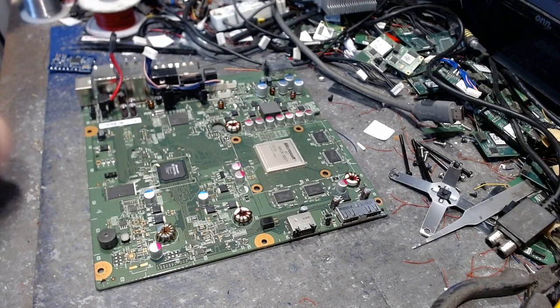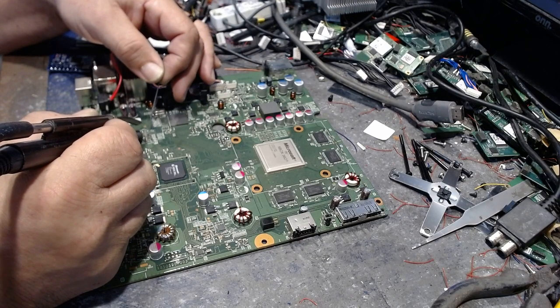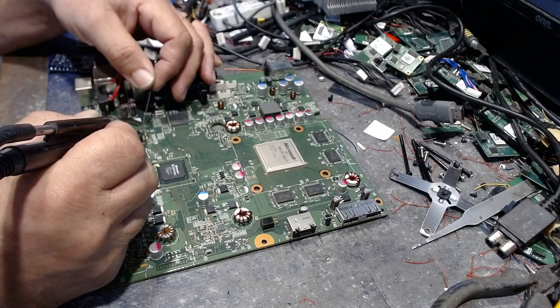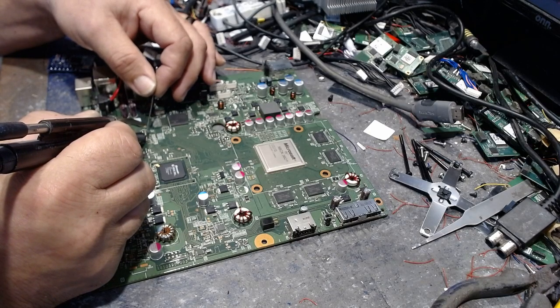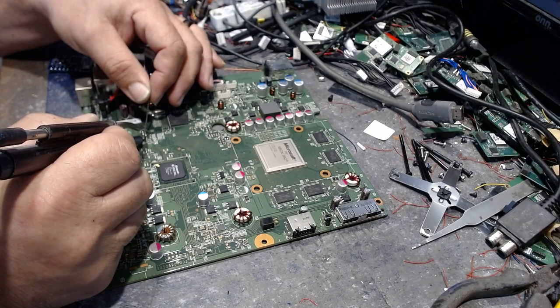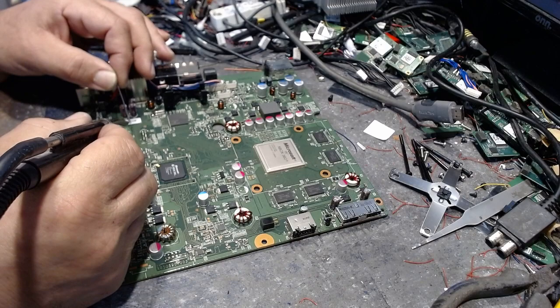Now we'll go ahead, and what we'll do is we will take care of the points. All right, so of course we got our X flasher connection, which is J runner connection, which is, you know, pretty much standard right here. All right, pretend that this is our 3.3 volt right here, which we're going to pretend. This is our ground right here, which we're going to pretend. All right, and then we have our other NAND read wires right here.